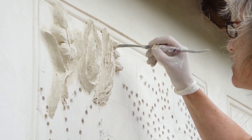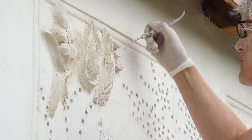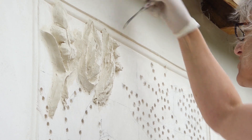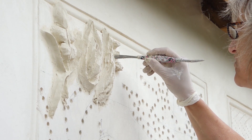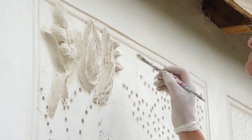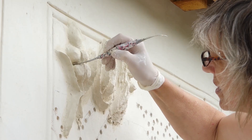The bit I'm doing here are some little dots. I thought they were a great idea when I did the design. But if you look at old parget, little dots like this are one of the things that falls off most often. So it's really important to work them well into the surface — dig the plaster into the hole well and make sure it's a hemisphere dot, not a full circle.